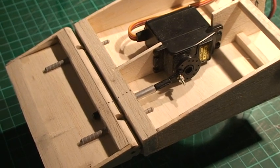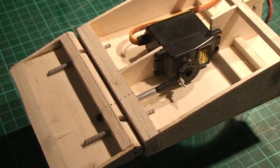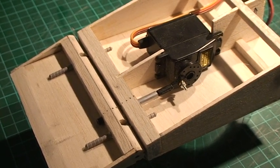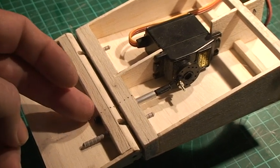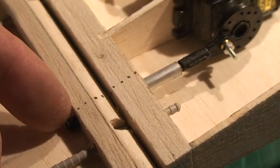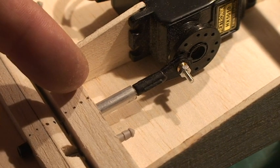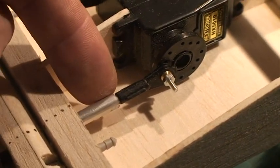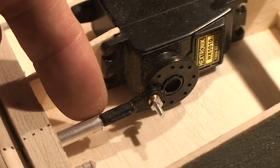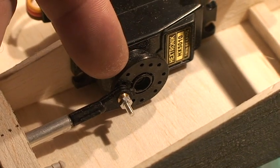Hi, this is a mock-up of the Fulcrum operating system to activate or operate an aileron or an elevator. What I've done is I've mounted a carbon tube inside the aileron or the elevator, whatever it might be. The carbon tube just passes forward and then slides inside an aluminium tube. The aluminium tube is fixed via a threaded rod which is epoxied to this ball joint, which is then attached to the servo.